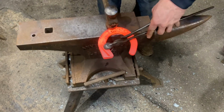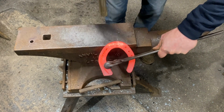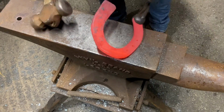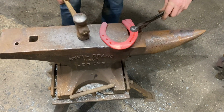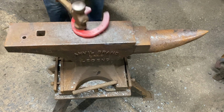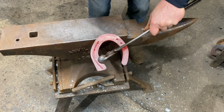So I'm going to go up to the edge. I'm holding it with two pairs of grip points: that side, that side, that side. I'm going to flip it over, and now it's most important I see it square. It is square, so now I'll drop it back and I simply hammer, which we all say never to do, this inside edge back down. It's very important we don't want sole pressure there. And then we're just going to come up and gently straighten our line.